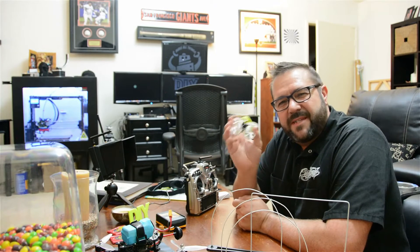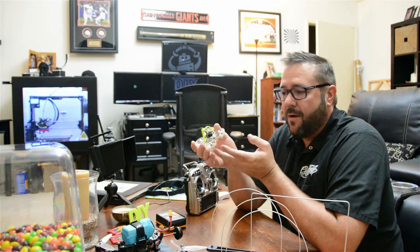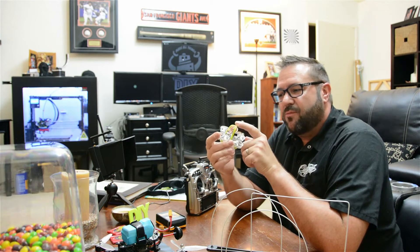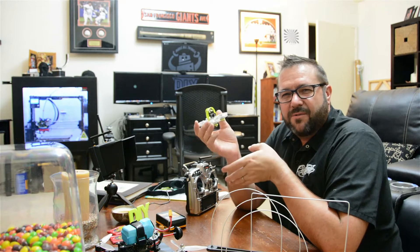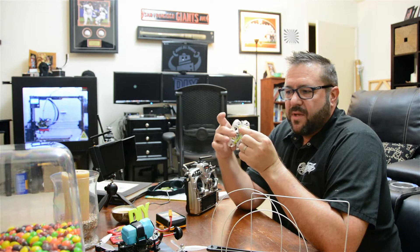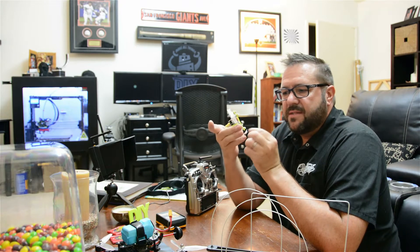This is probably the biggest mistake we could have made, because we've been flying this thing for about the past four days. We've made a few improvements though. When the battery dies, you get about one and a half seconds to land or else it falls. We noticed it always lands on the antenna — we actually broke the antenna a couple of times. So one of the first things I did was 3D print some roll bars. They're about 1.25 grams, so it doesn't add too much weight. We also found online a way to improve the motor mount structure, since the mounts are held up by three very thin 1mm prongs inside the air ducts, and hitting at an angle tends to break them — we noticed one already got broken.